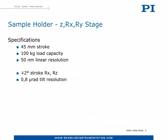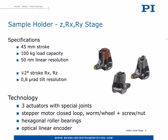The lifting stage is actually made of three identical Z-stages placed symmetrically between the X-stage at the base and the tomography stage on top. By controlling them with interpolated motion we can easily command vertical motion, tip, tilt, or any combination of these three degrees of freedom.